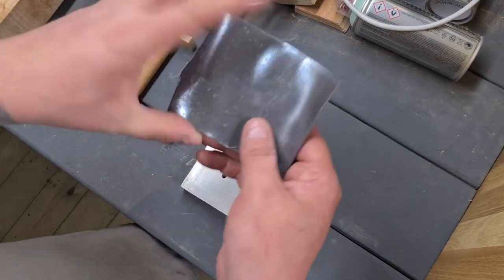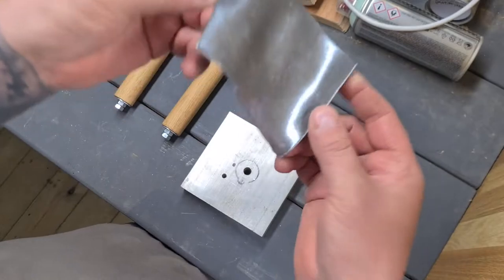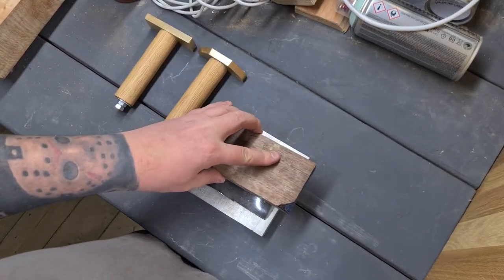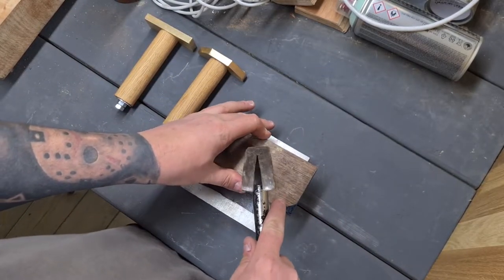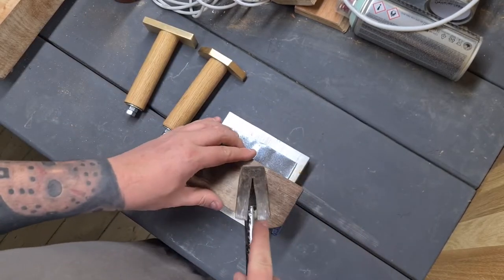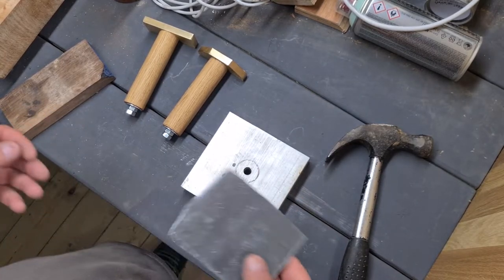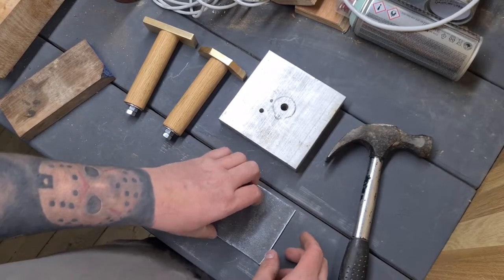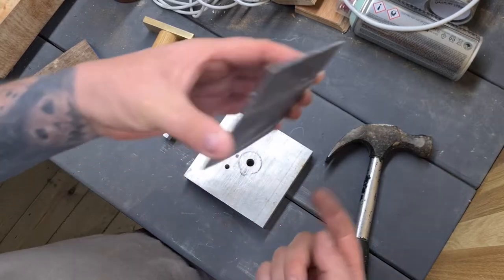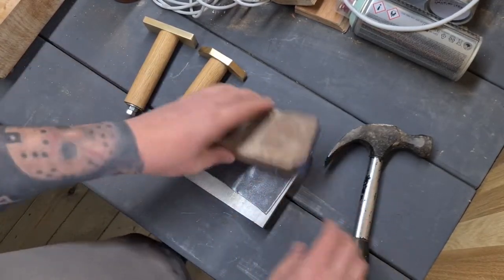What we've got here is just a piece of lead cut off a lead roll, cut with tin snips. As you can see, cutting it with tin snips leaves it quite distorted and wavy. So what I do is get a block of hardwood and use a nice flat piece of wood to hammer it flat, giving it a few little taps. I always do mine on a nice solid surface — a big block of aluminium. You wouldn't get such a great result doing it on a wood surface because the wood is too soft. The aluminium is much tougher than the lead, and the brass stamp is also much tougher than the lead, so the only thing that's going to give is the lead, ensuring you get a good impression.